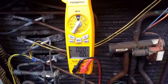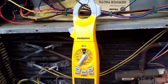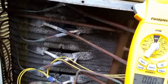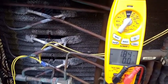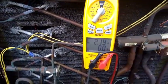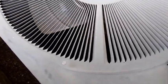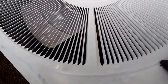Let's fire it up and see how many amps we have on it. Get something to press the contactor down with — I don't like touching it. Make sure we're spinning the right way too. Below amps required — good. Spinning counter clockwise. Yes, of course it's backwards because I did it again. Test run here — we're going to swap the fan leads.